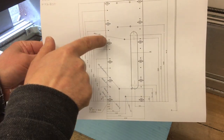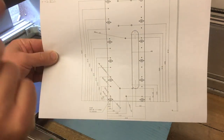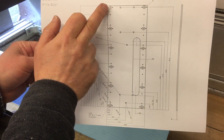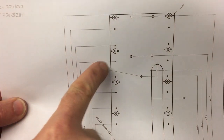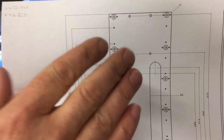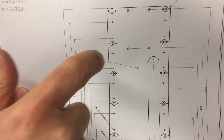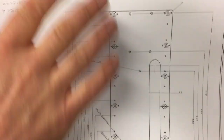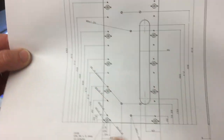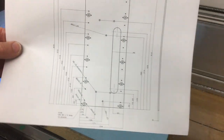The sets that are every 60mm, they're going to be tapped M5, they're to hold the linear rails on. But underneath those you've got a pair of grub screws, I'll just zoom in there. You've got grub screws either side of a countersink screw, so that will be countersunk below the surface so the rail will sit flush. And then the idea is that clamps this plate down onto those box sections, but the little grub screws give you some levelling, so you've got levelling all the way down to bring this plate into line, so it's all in line with the quill.